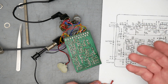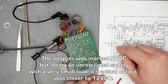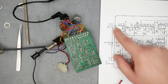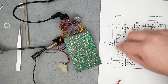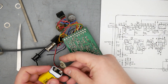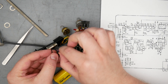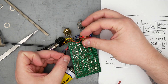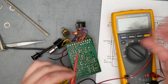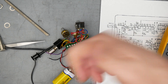That's right - these early Boss pedals use the Boss proprietary adapter that wasn't nine volts, it was 12 volts. They're dropping down the power from the AC adapter with this little diode-resistor series combination to run at approximately nine or ten volts. And if you use a battery, that bypasses this string - it's shorted out across this. So this isn't in circuit when the battery is connected. If I just connect the battery to the circuit directly and turn the pedal on, now the LED comes on. So now the pedal is on. And if we check the voltages, now we're getting 8.3 volts, which is probably about right for that 33 ohm resistor dropping the voltage down a little bit. I bet with the nine volt battery it's going to work fine.